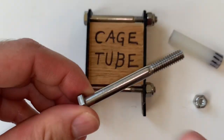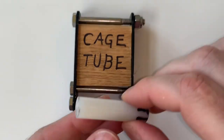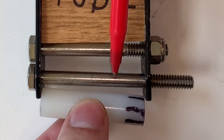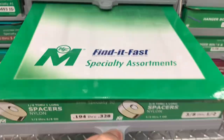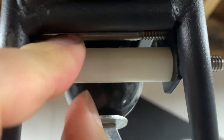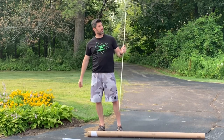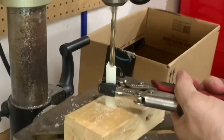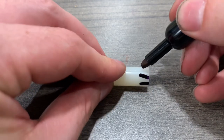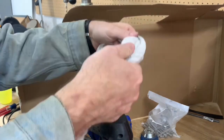Let's talk about the roller, then install the kit. I'm using the smooth, unthreaded part of the bolt for the roller axle. With a correct-length bolt for the brackets, a portion of the rolling surface is on exposed threads — I don't want that. So I'm using a longer bolt so the entire roller contact surface is smooth. This results in a few extra threads sticking out past the end of the bracket. For the roller, if you go to the hardware store you will find short plastic spacers — do not stack short spacers, as the resulting seam in the center can damage the cable. A full-length roller is required; you may need to purchase it online. I cut it to length, then bored it out to fit the axle, and made some timing marks around it to make it easier to see it rotating. The unthreaded portion of the axle bolt can be rough and create excessive friction, so I polished it to give it a smooth surface so the roller will rotate smoothly.